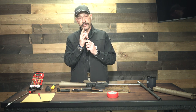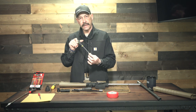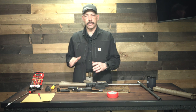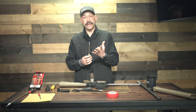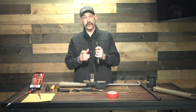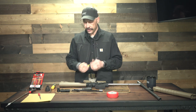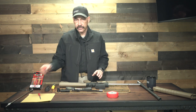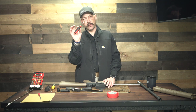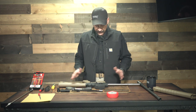These are from Wheeler — they have a hollow-ground screwdriver bevel that gets all the way to the bottom of the slot, gives you that full meat to engage with, and less opportunity to strip that screw out. They also come in a variety of sizes in a whole kit. If the screwdriver slot is too wide you can mar the finish of your gun or dig into the metal. You're also going to want some sort of a pick — I like one that's a little bit curved.